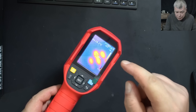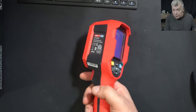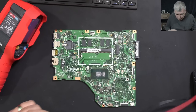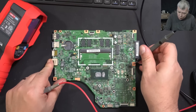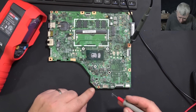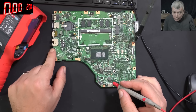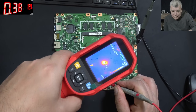Probably because of the camera's dynamic range, you just see a yellow thing on screen, but I can see shades of yellow on the actual camera. Here's a motherboard — I received it from a customer, not sure of its story. Trying to power up the board. We should be able to diagnose it using the thermal camera. On the board, there's the charging port area, a fuse, and a diode. And the board is starting — I can't believe it. Bringing the power supply on screen — we have current flowing and the board is starting. You can see the CPU.